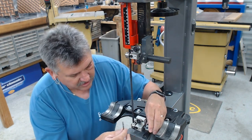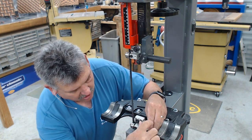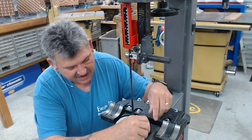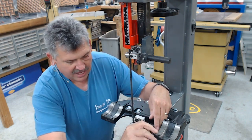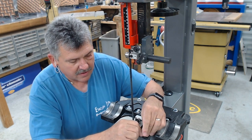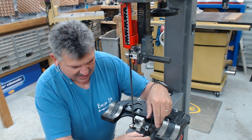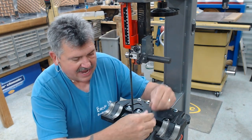Use the 1/8-inch wrench to loosen the bottom so that you can bring the side guides up to just behind the deepest part of the gullet. Then loosen the post with the 5/32-inch wrench and bring those side guides up to where they're just behind the gullet, making sure they're in line. Then, to align the back thrust bearing, loosen the bolts we installed but didn't tighten, and move that to the side to line up the thrust bearing so the blade is right in the middle of it. Now snug those down.